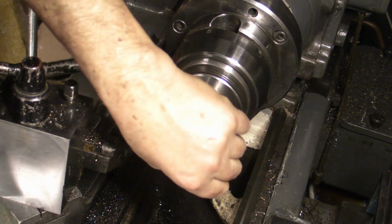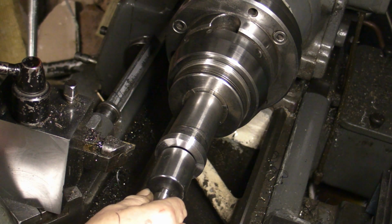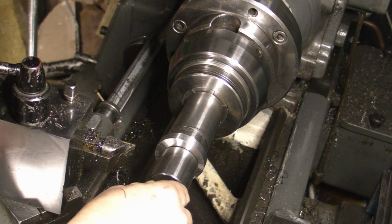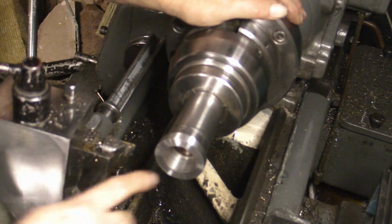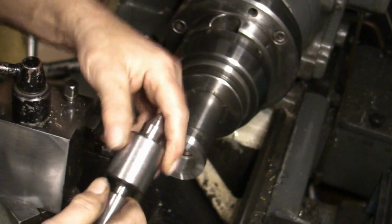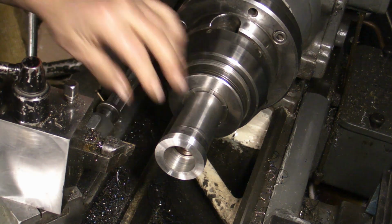Probably got about 10mm thickness of wall now. Taking the thread down, so that's a bonus. We're just touching on the back now. Instead of taking any more up, guys, I might just shave this leading edge here so it allows the solid part of the body to go in. Yeah, before I do that, I'm going to take this down to the 1 3/4 inches.